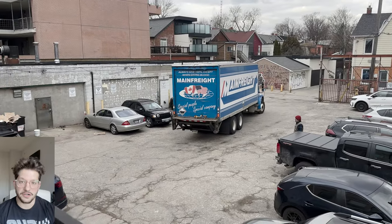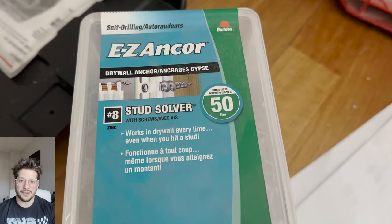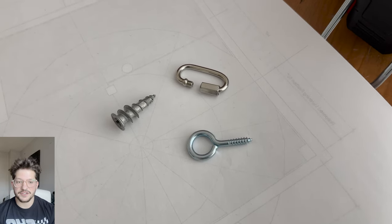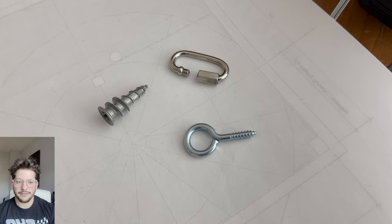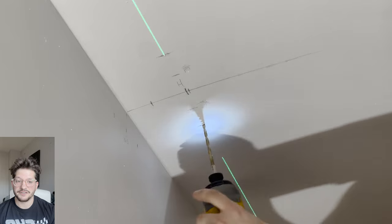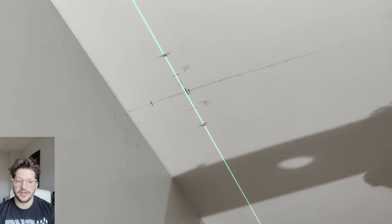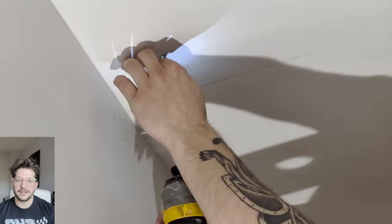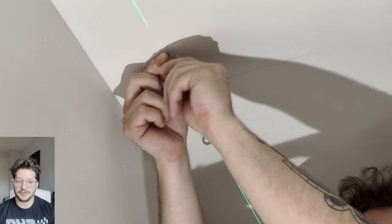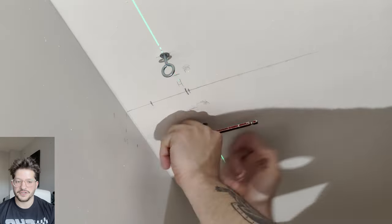Part of the room essentials package from Signal Acoustics is that they ship all of the panels on site — there was the truck pulling up with all of the panels. Here are the anchors that we use: you can see the eyelet screws and the locking carabiners. That's the hardware, along with the chain, that we'll be using to actually suspend these clouds from the ceiling. To mount this hardware, I am marking out and drilling holes that the anchors can screw into, and then I hook right into those metal anchors.